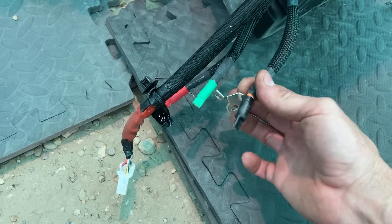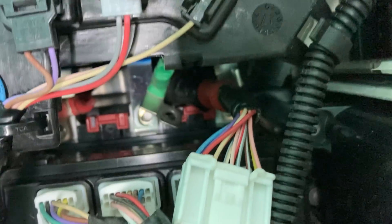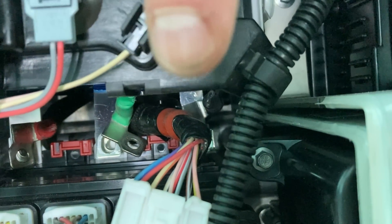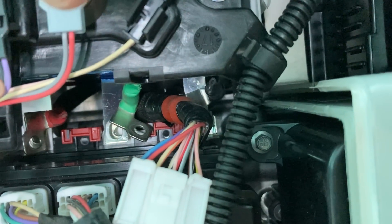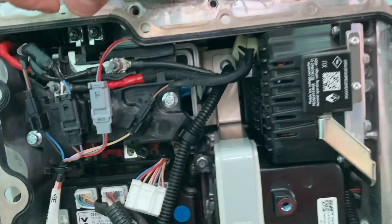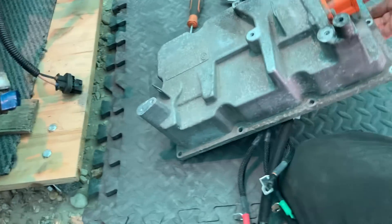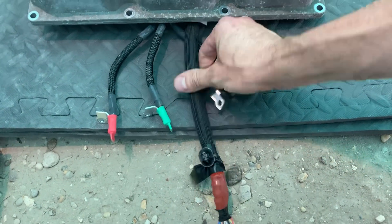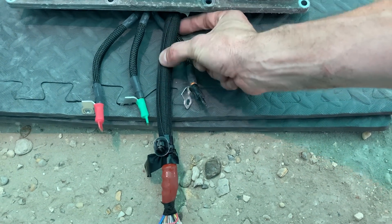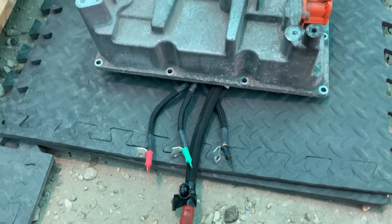Another thing: the actual tabs underneath come from the blue capacitor. You can bend those as well - that's quite easy. One of them I just couldn't wiggle in - I think it was the green one because the comms cable's in the way - so I just bent that tab upwards a little bit, enabling me to slide the metal of the green one onto the side and then push it back down again. In terms of the order the cables go in: it's red, green, black, and then this big cable goes basically over that one. You've got tabs one here, one here, and one there.